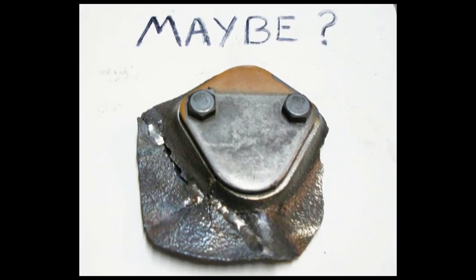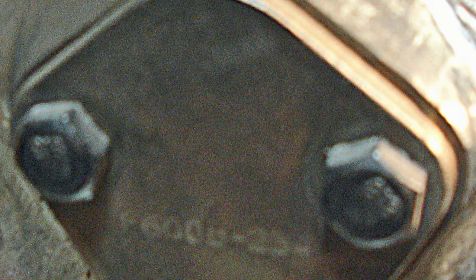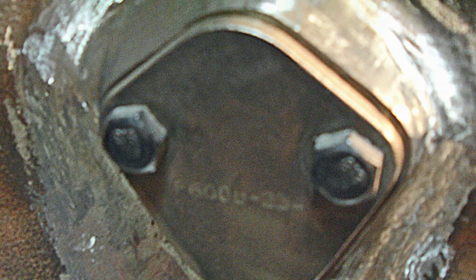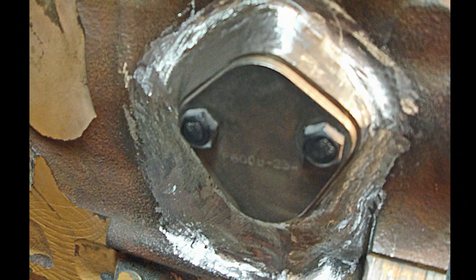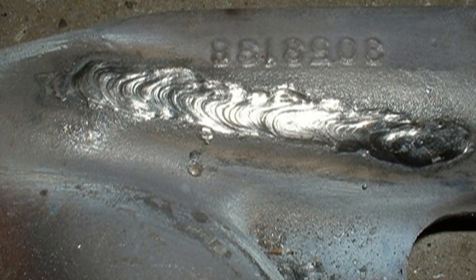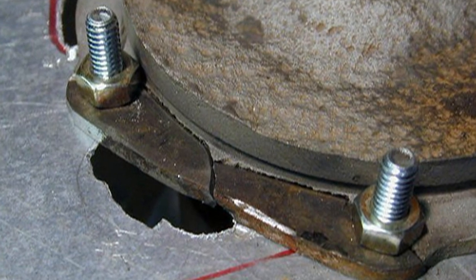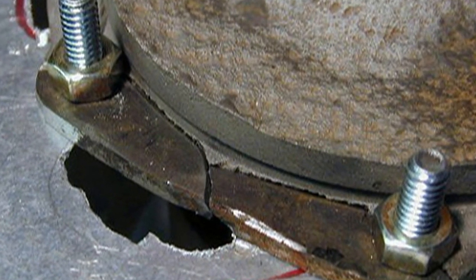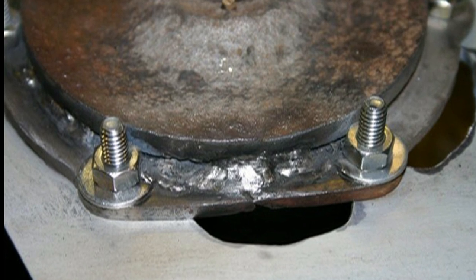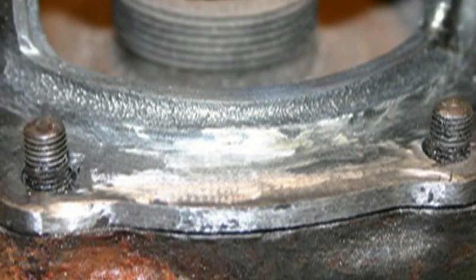This engine block was TIG welded with our 77. The customer knocked off the coating, but many of our customers leave the coating intact. This same block could have been arc welded with the 77 arc rods. On heat-affected cast iron, lay down a root pass of the 72 and finish with the 77 for excellent machinability. Here is yet another customer welding up a pump housing broken to pieces — it was an old unit and not easy to find parts. If you have the right tool, you don't need to find a replacement part. Muggy Weld has innovative products that eliminate downtime and save you money.